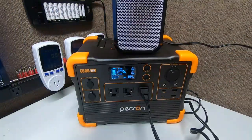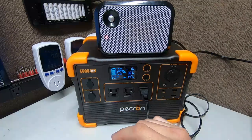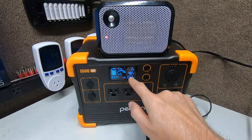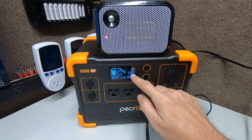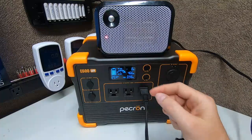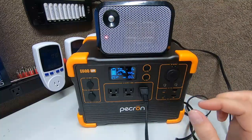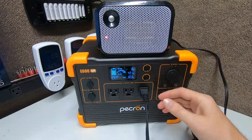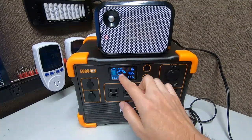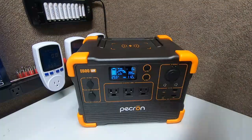With the heater plugged in, notice the speedometer is at 25 percent — correct for a 1200 watt inverter. Then it surged up to 50 percent at 532 watts, then settled around 454 watts which is technically just under 50 percent of 1200 watts. The gauge dropped back to 25 — so it's not 100 percent accurate, kind of a fool's gauge. But the actual wattage reading is pretty accurate. This is helpful for newcomers to track how much power they're using.